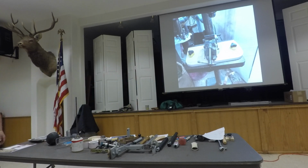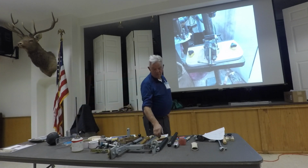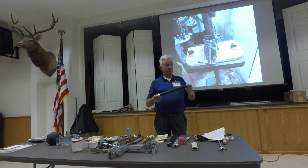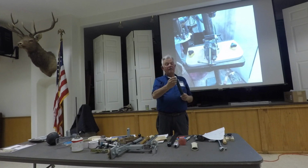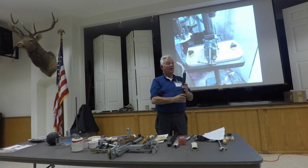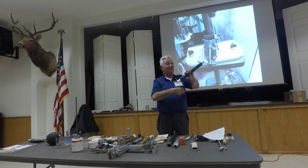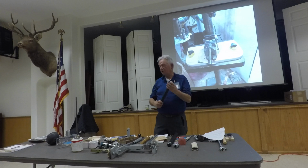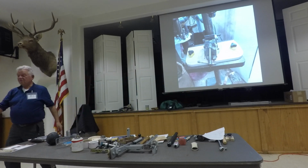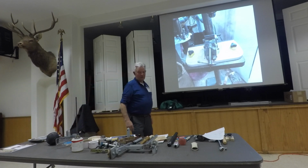These are the things that, the reason I say I like something is because I'm a little bit cheap. Casey didn't make it tonight. This is a handle that he made. It's really a piece of 1-inch aluminum. He drilled a round hole into it. I turned it into a rectangle because I want to use my D-Way parting tool in here. And actually, I think I'm going to drill a hole in the other end and tap another hole in it, so I'll have a double-ender handle so I can use it 2 different ways. But this is something that is cheap, it's easy to make, and doesn't cost a whole bunch.